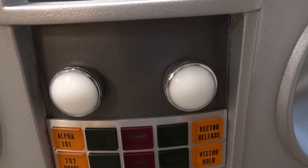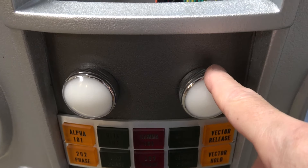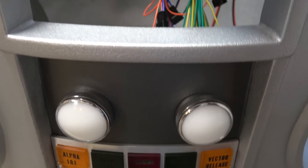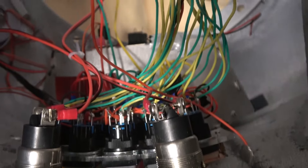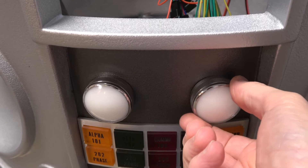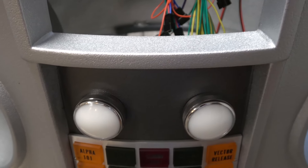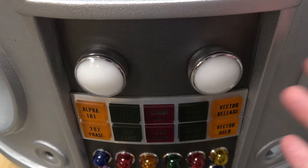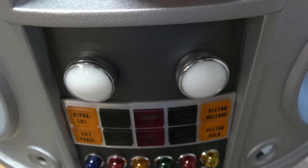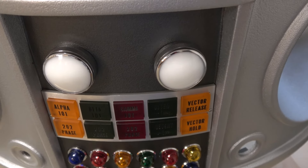You can see I have my chest lights in here. The way it works is the socket goes into it — it has a little ring on it that stops it. On the back, you just put the nut and the washer, then you wire it up. What's nice about these is they just screw off on the front, and you can replace the bulb and screw it back on if needed. So if you buy the LED and it burns out for some reason, you could easily change it without tearing any part of the inner side of the robot apart.